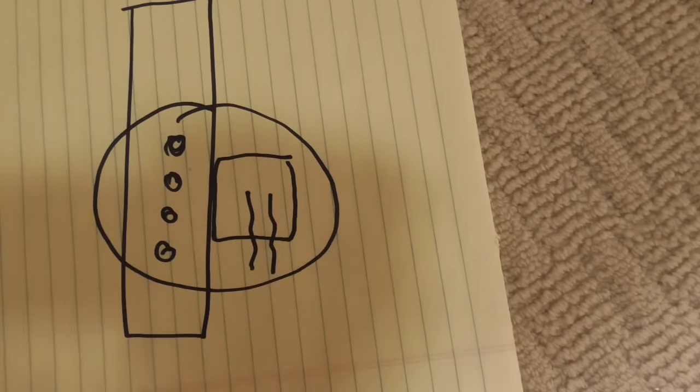This is the stud over here. You route your wire through there, and it's completely pushed in, because the wire is very thin, probably an eighth of an inch, a quarter of an inch. So you've got all this extra space inside the gap that you gouged out between the two holes. So the wire goes through here. Used a staple to staple it down, the wire staples, and then went in there with drywall compound and patched this whole thing up.